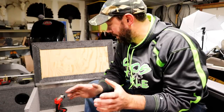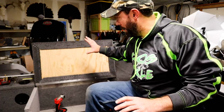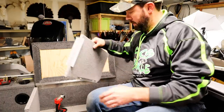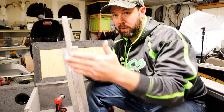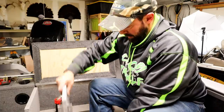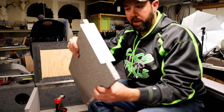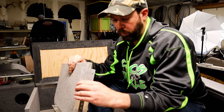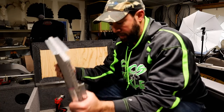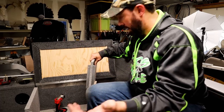We have made some progress. Last I talked to you we had the hinge on the lid, and now we actually have the lid on the boat. All of our cross braces on the bottom side here — we've got three-quarter-inch angled aluminum so that it can be screwed to the floor. The pieces up front are held on by 10 by 24 screws, inch and a quarter long, with nylock nuts. That's what holds this all together and what's going to hold this in place and give it stability.